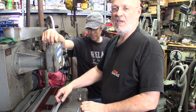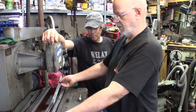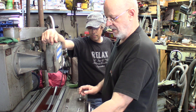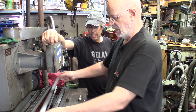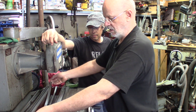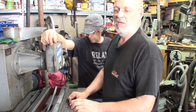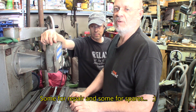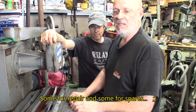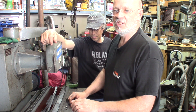As a replacement for these wear bands, we're going to use wear-resistant spring steel — 1095 steel, Rockwell hardness over 45. It comes in the right width and in rolls — 25-foot, 10-foot, or 100-foot rolls. It's available at McMaster-Carr at a reasonable price for the quantity we need. We expect to get it fast enough to go back to work and get the machine rebuilt soon.